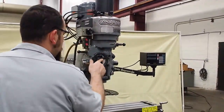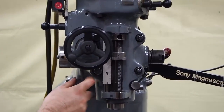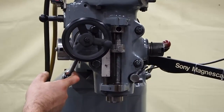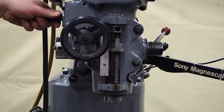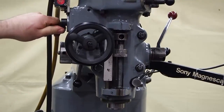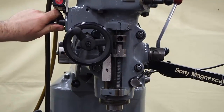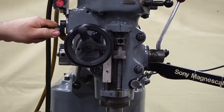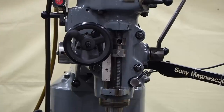We're going to reverse — push the little button in the front, it reverses the feed. And back for a second until it comes off the dog and stays engaged. The other side has three different ranges of feed: this is your fastest, this is your medium, and this is your slowest speed.